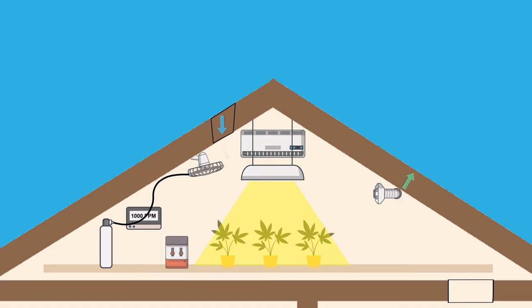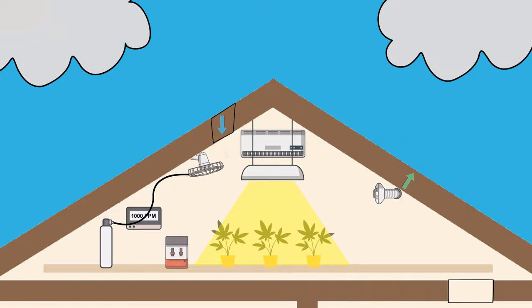While this step is completely optional, there are a number of benefits that come with adding an air exchange option to a sealed environment. By building both open and closed-loop systems into one grow space, you can effectively run a hybrid system — taking advantage of the outside environment when it's favorable to adjust temperature and humidity quickly and to save on costs. Then when the outside environment isn't favorable, you can just run the full closed-loop system. Having outdoor ventilation also allows for a backup plan in case of emergencies if something breaks down, and there's also the concern of quickly replacing air if something goes wrong with air quality in the sealed space.